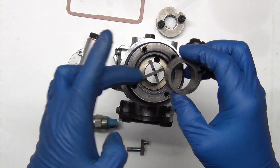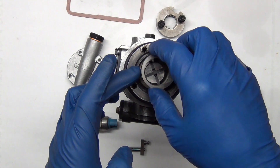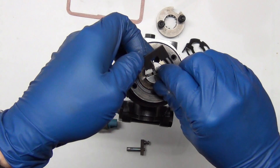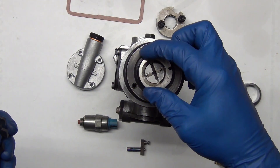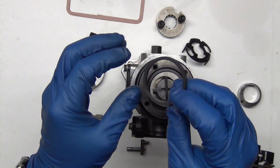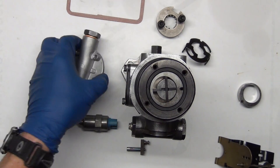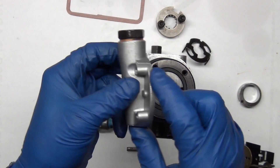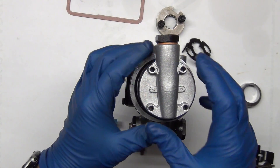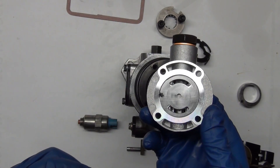So I can see that my vanes are oriented this way, so I'll turn this accordingly. You should put the liner on first before the paddles — so this drops in first. Then there's a flat O-ring, mostly like an oil filter ring, that fits on the back. Then the regulator end plate goes on the end — it's got a little tip that corresponds to a cutout, so when they line up, it fits. Then I'll show a quick time lapse of how this all goes together.